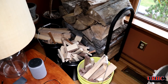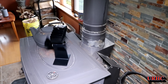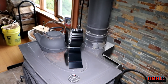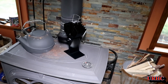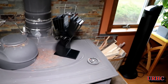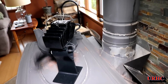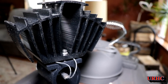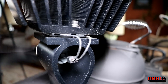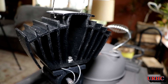You can see I've been cutting up kindling wood in my shop — cut up like a dozen buckets full. There it is, pretty much running. I've got it pointed towards the front windows because, as they say, don't have the heat sink pointed towards the chimney pipe — that will make it run slower because there'll be less temperature differential. I'll show you in a little while exactly how these thermoelectric modules work; you can see the thermoelectric module in there and the little motor that it runs.